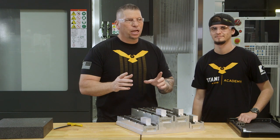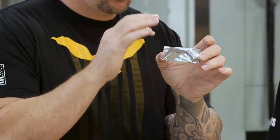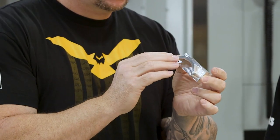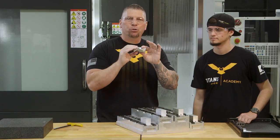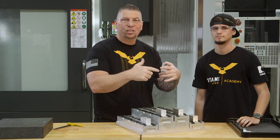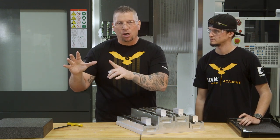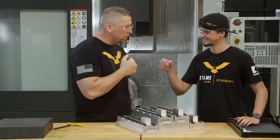To end this vlog, I want to end with a word. A lot of people look at complex, crazy aerospace parts and think that's where the money's at. But don't lose sight of the fact that when you look at easy, simple parts — in this case, one that has multiple features around it — you can actually make a killing by figuring out how to produce these parts efficiently. And that's all in the fixture. Make sure you look at both sides of the coin: producing crazy parts that are one-offs or ten-offs, or fixturing so you can run tens of thousands of parts in production runs and produce the work here without having it outsourced.